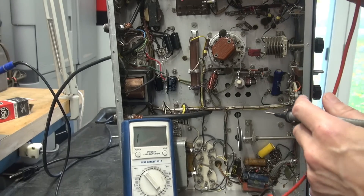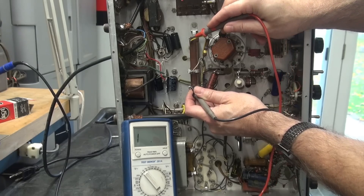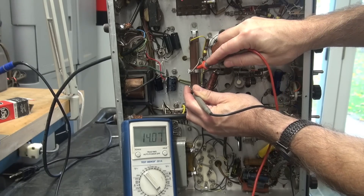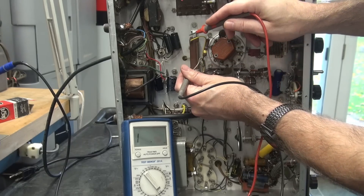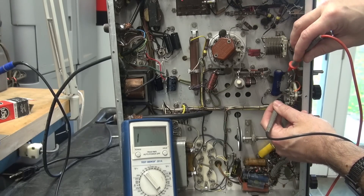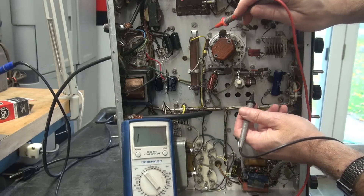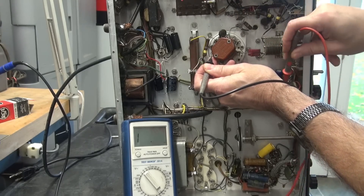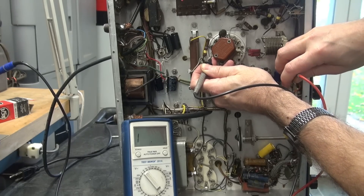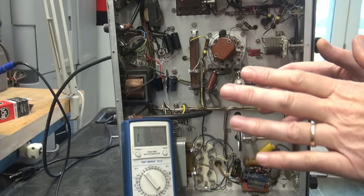I think I know what's going on. Remember that big resistor for the modulator current? It should be 20K but it just keeps reading higher and higher. From the center tap to one side it's around 15K, but from end to end it's open. There's also a 10K power resistor down here and that's wide open too, and both of those are in line to the screen voltage — which comes in on pin 2. So screen voltage comes in, goes through the 10K to the switch, and it can't because the resistor is open. I'm going to swap this and see if the screen voltage comes back.